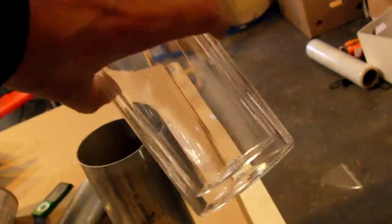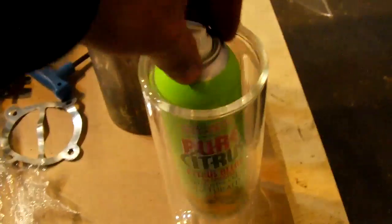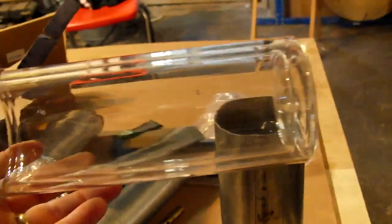In regards to that small Stirling engine I showed you with the glass displacer piston — this is what I'm thinking. This is a borosilicate glass container that I was able to get. I found these for a pretty decent price — they're kind of expensive, about $35 a piece. But this particular glass can handle really high heat so it doesn't shock very easily, and it's different than the tea container. So if you break this you won't get a certain somebody mad at you. You can see this could be used for that if we had the steel wool at the end. This is just a scaled-up version of that. Somebody sent me a video of this concept actually in action on a small scale that somebody made.